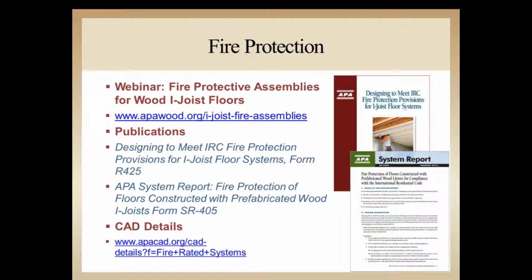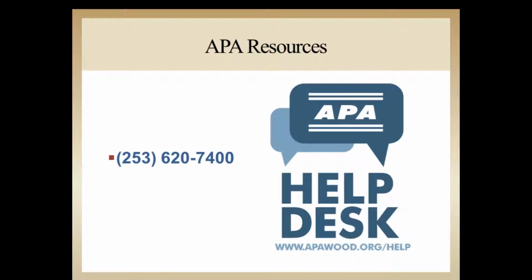I want to touch quickly on fire protection. If you've been involved in the code side over the last 2 code cycles, since 2012, you've been aware that fire protection has been mandated, and it's handled jurisdictionally differently from city to city or county to county, but the ICC IRC does require fire protection. So we've got a couple of publications you can see here, R425 and SR405, where we discuss those fire protective systems for I-joist that you can get on the APA website. And we've also got CAD details to match.